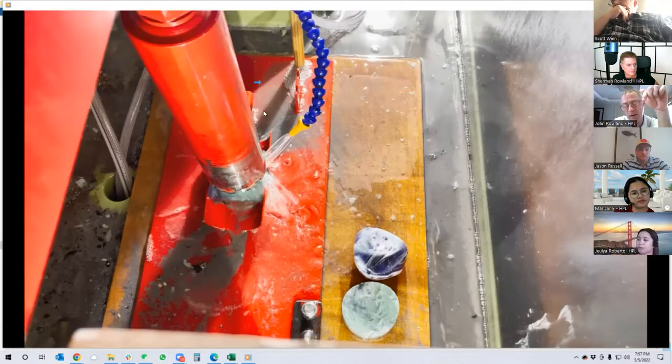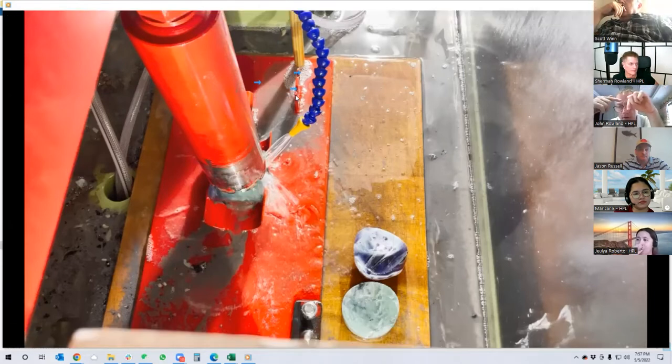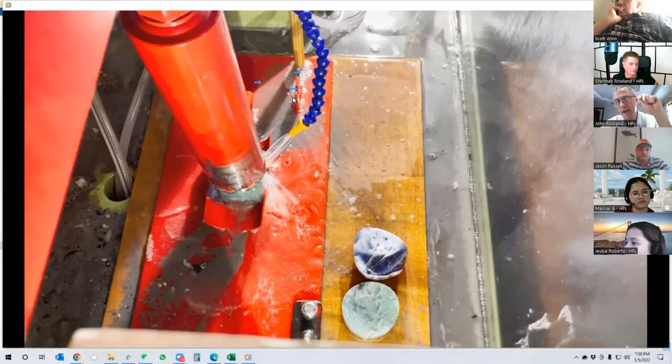Point at the left-hand notch there, Sherman. No, that's the right hand. That notch. Mm-hmm. So that's the right-hand notch that you just marked and the left-hand notch is right below it. So you want your pin touching the edge of the core in your left-hand notch. Now, what this does for you is that when you start the third and the fourth, and if you drill a fifth, you can get it right up against that pin, start your drill, get your set, and then you lift that lever up and back it off.